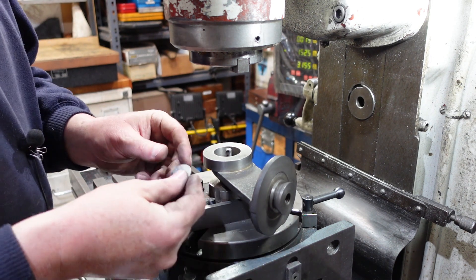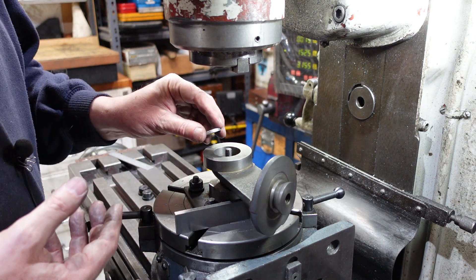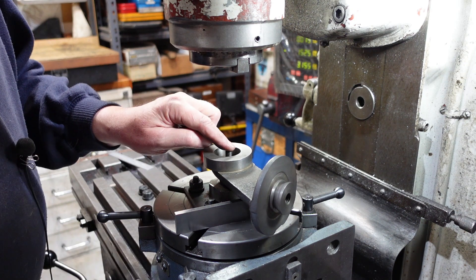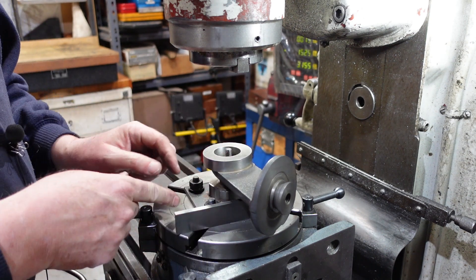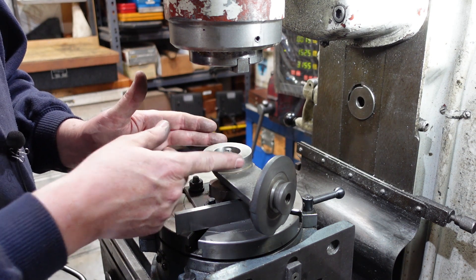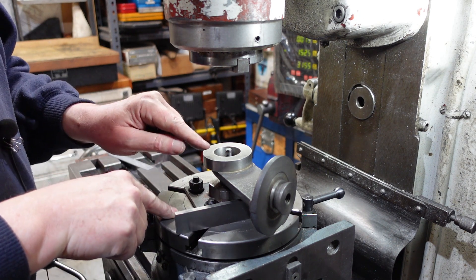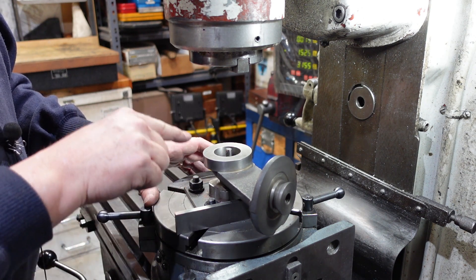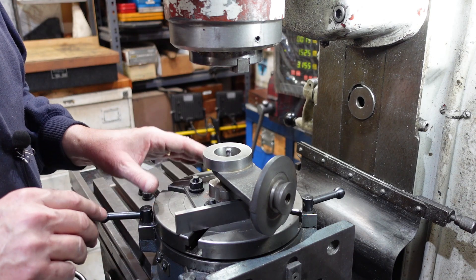What I'm going to do now is use a couple of washers - I'm using a couple because I want something nice and thick to hold it. A couple of washers in there, a nut, and then I'm going to put a strap across here, centre all this up with a dial so that the rotary table axis, which I've already zeroed, is going to be the same as the axis of this. Then I can take it off the machine table knowing that when I rotate the rotary table, this diameter is going to be concentric with the axis of rotation. That way I should be able to put the engravings on there and everything should stay concentric.